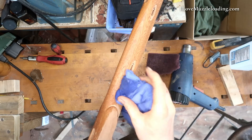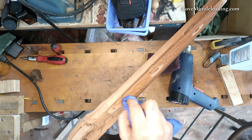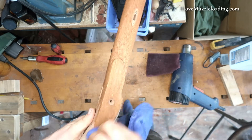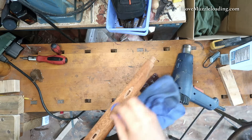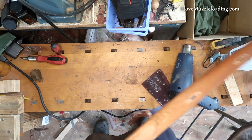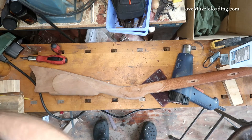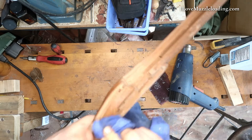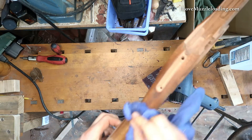You can really do this as many times as you want. I'm not the kind of person that wants a super smooth, super clean, shiny polyurethane stock finish. I want it to look good, feel good, and function. For my personal pieces, muzzle loaders that feel kind of plasticky with so much finish — I like a real natural finish, like they would have used: simple stain and simple oil. I think sometimes with modern finishes we get a little too perfectionist with them. I like to be able to feel the wood, and with things like polyurethane, a lot of times you get a coat on top of the wood that prevents you from engaging with the wood itself. That's just me, though — if you like a nice clean, really super protected, polished piece, more power to you.